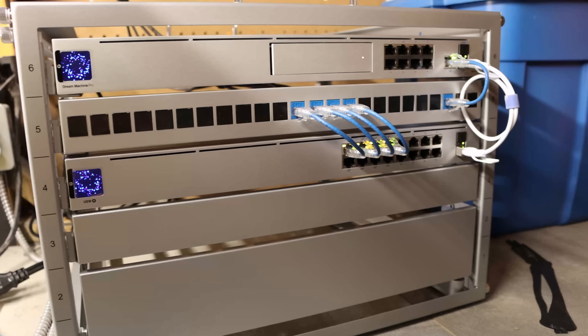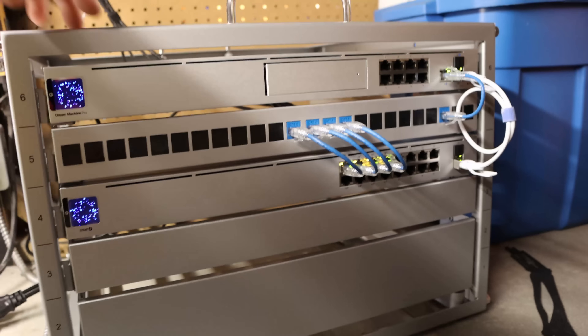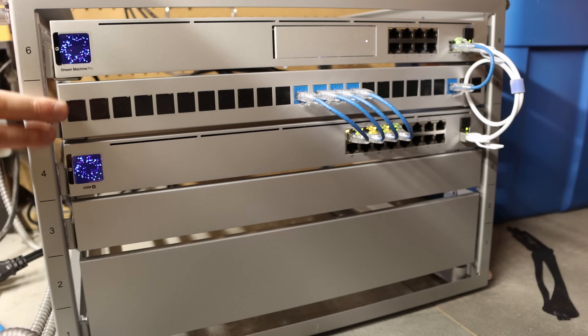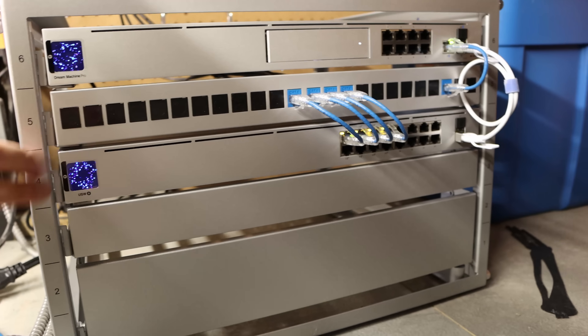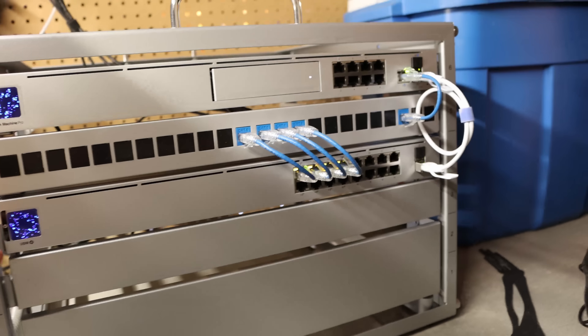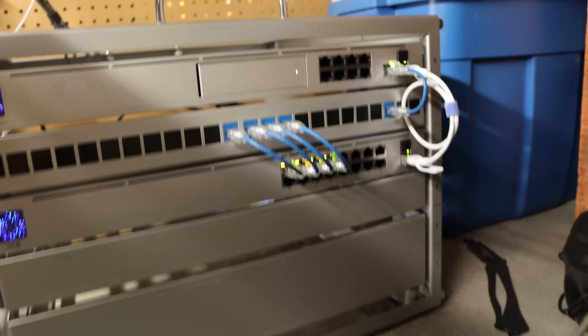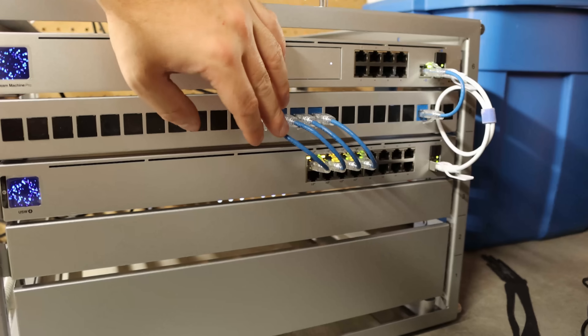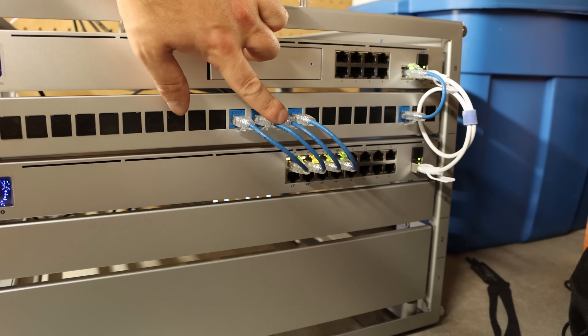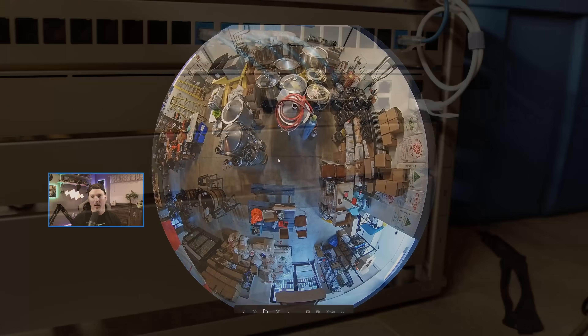We're all finished here at Turkey Shoot. We have our UDM Pro at the top and then this is the Tool-less Mini Rack. Below that we have the Ubiquiti patch panel with black keystone blanks. The switch we're using is the USW-16-POE — it only has eight POE ports but we only have four things running here: two AI cameras, a G5 camera, and a U6 Pro. On the end we have the DAC cable and a couple of Ubiquiti blanks just to make it look good.